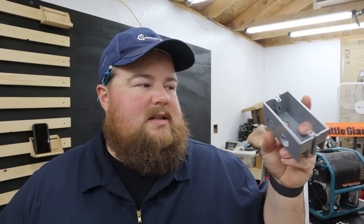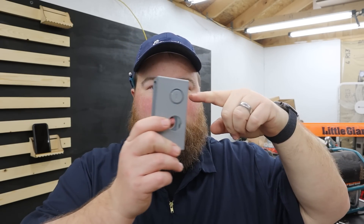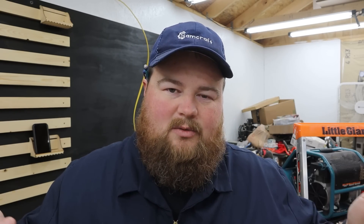I tried to drill a hole through the top plate of my wall first to make sure everything was totally hidden, but there was not going to be any clearance there. And then it also brought up the issue of: when I insulate my ceiling and do my ceiling covering, what am I going to do at that point? So this is what I came up with. What I have in my hand is what's known as a handy box — basically a plastic junction box. I have a knockout punched out of the back here, going to the wall, and the Romex is going to stick through this part. It has two knockouts left and right — this is going to be my circuit, which is probably going to be the flexible conduit wire, running in, able to junction, go towards the outlet, and then keep going left or right. This is my solution for doing my electrical in a very unique way since I've already closed up my walls and insulated them. This is the best thing I can come up with that prevents me from having to run a bunch of conduit, have a lot of exposed tubes on my walls, and gives me the cleanest installation in the end.